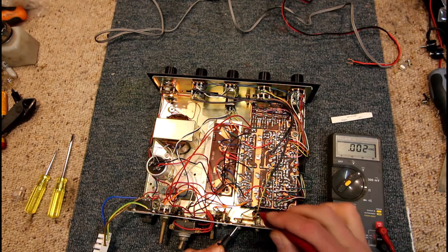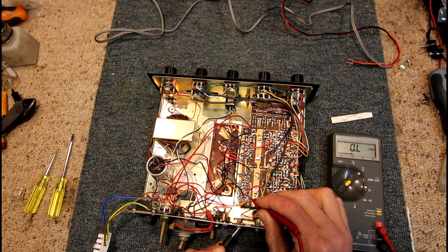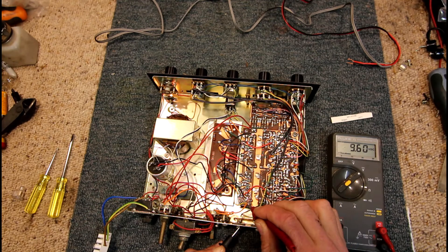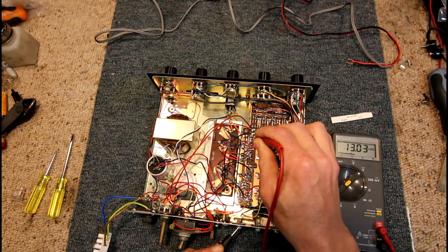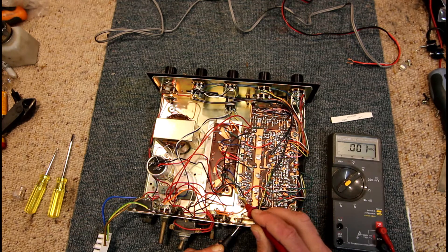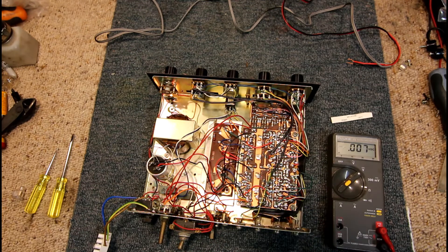The RCA socket outer will also do as a good ground. This looks like it is an actual ground. We've got 12 volts there — is it connected to that? No, that's a separate pad. We've got 9.6 volts but that's probably just the charge on the cap. That side doesn't have anything, so maybe not. 13 volts on that one. That's got 9 volts on it — that's not a good sign. But I would have thought that would be isolated from everything. That goes into a pot. Yeah, this is a real mess.